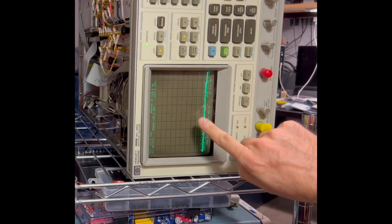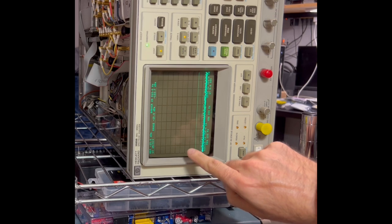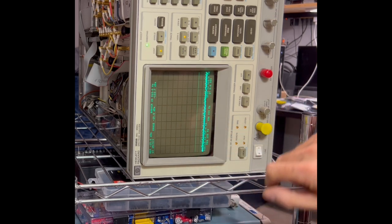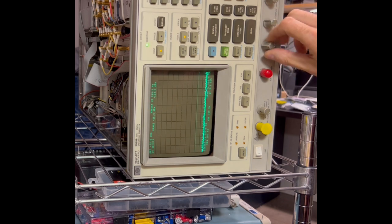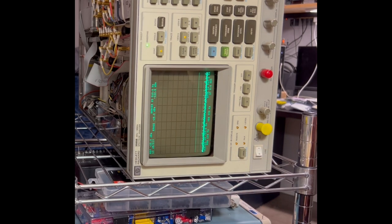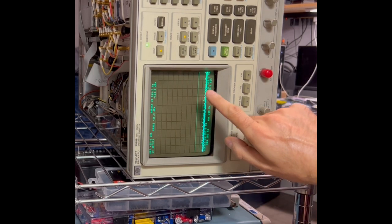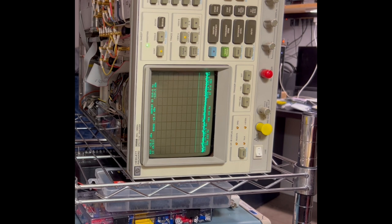Let's see what we get here. And there is our display — that looks very good! Focus control, intensity control — yeah, that looks real good. One thing we'll need to do now is check the voltage reading and make the adjustment. I'm going to get the manual out and look at the CRT control and high voltage power supply adjustments section, which says to put the A67 on an extender card. I don't have that extender card, but I have checked the voltages.